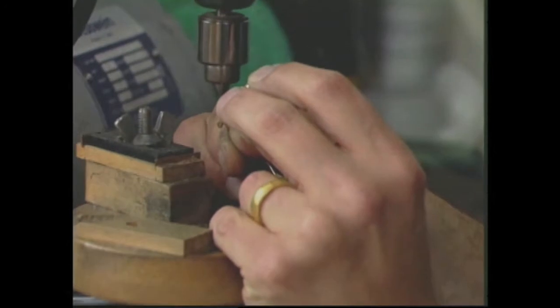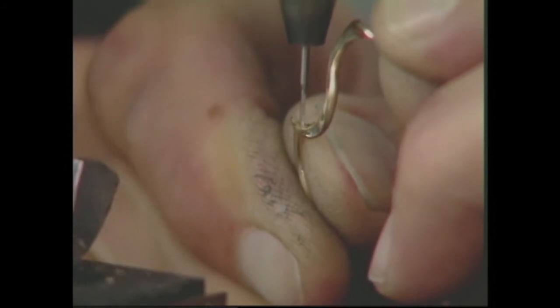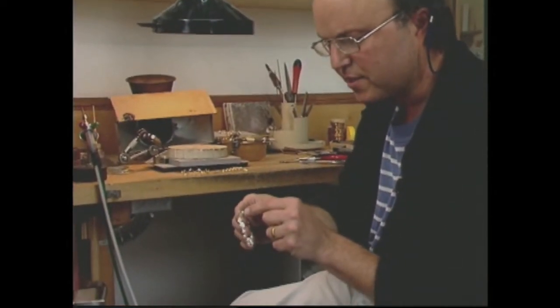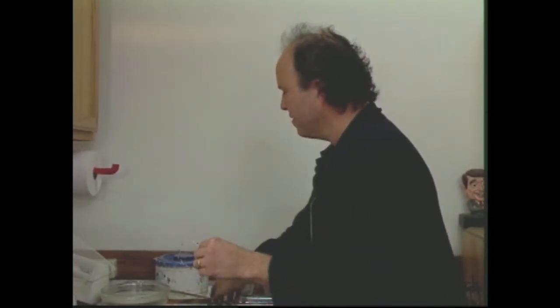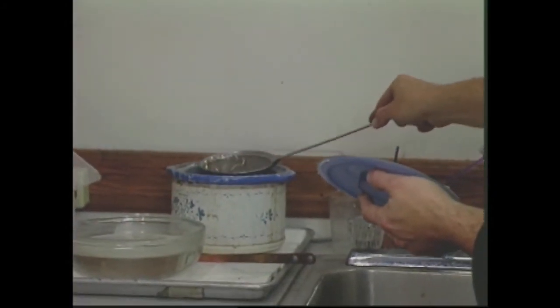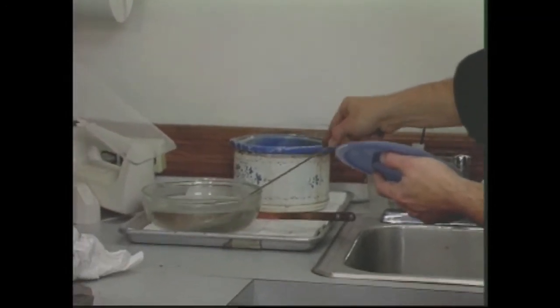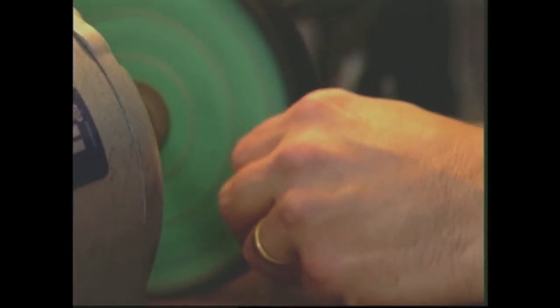We're going to need a little hole in the last S's here, because the pearls are on a wire that's wrapped around — the wire goes through a little hole in the end, gets melted. This is the first real quality control step: the jeweler who just made the piece knows if there's some little thing that needs to be corrected and will do it now. Before we polish it, because we heated these ends there's a little oxide on them, so we just need to put it in the pickle — which is an acid bath. It takes very little time; just a very light coating that won't polish off, but once the acid takes it off it polishes really well. During this step I'd be looking for little problems, like a little pit that came from the hammering.